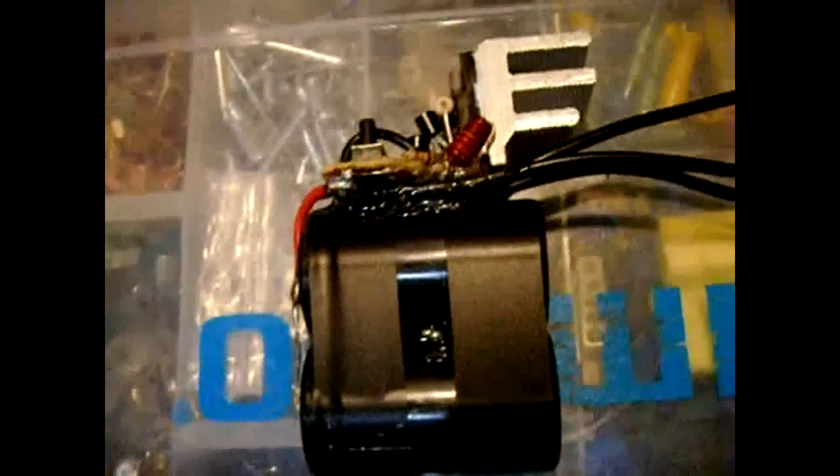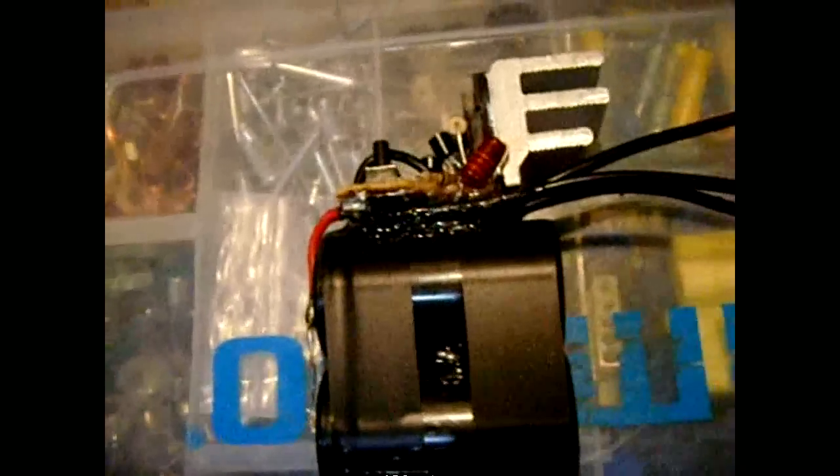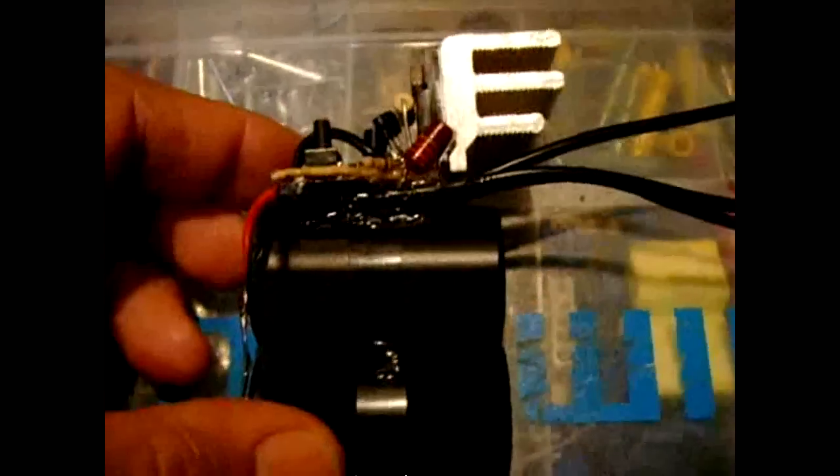There are a lot of uses for it. But if you use it someplace where there's a chance that it can possibly fail and open the circuit when it shouldn't, then you should put a bypass switch between the plus on the battery and the drain on the MOSFET. So there are a lot of uses for this circuit, you just have to be careful what you use it on. Because even though it works perfectly, there's always a chance the circuit can actually open when it's not supposed to, and then you lose all power.